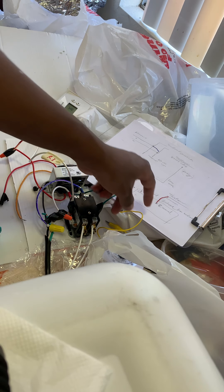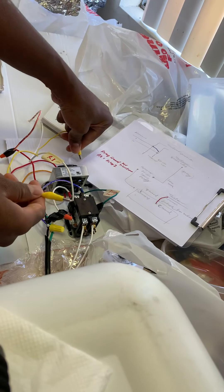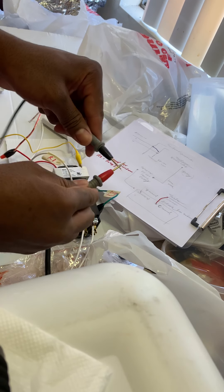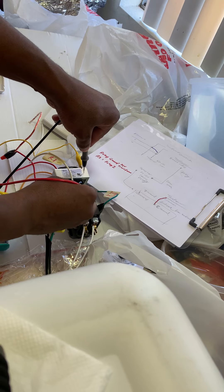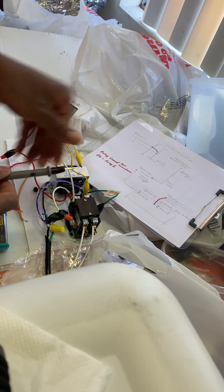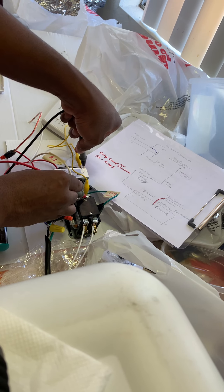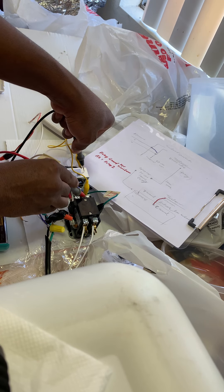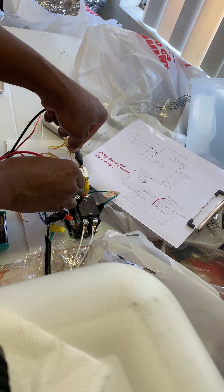Right now I'm going to simulate a short circuit. I'm going to take this alligator clip and put one end on the housing of the transformer. Now it's open. I've got my test lead, and this is in continuity mode — my test meter is in continuity mode. So if you go from here to here, you don't hear anything. However, if I simulate a short circuit, meaning power is going from the transformer to here, now you hear the meter is beeping. So basically, this is a simulation of a short circuit.